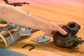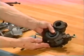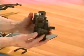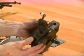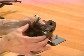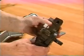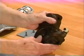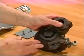Out in the front of our machine is this table drive assembly. This is what is used to determine whether our table is going to go to spotting height or respotting height. So any work with the table should include a visual inspection for wear in the shafts, roll pins, bearings themselves, to ensure that this will always lock to give us respot height or unlock to give us spotting heights.